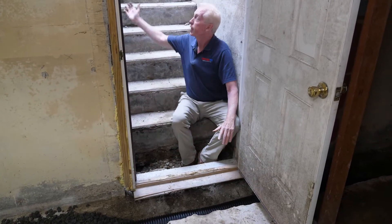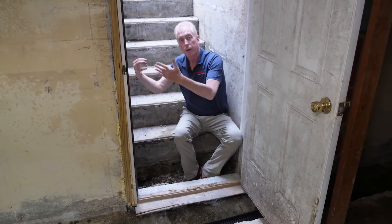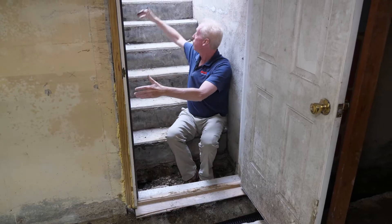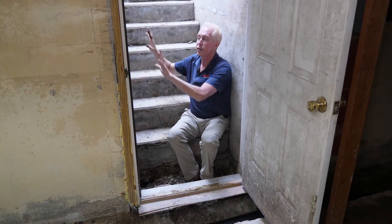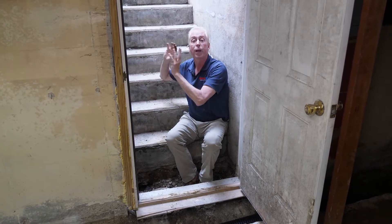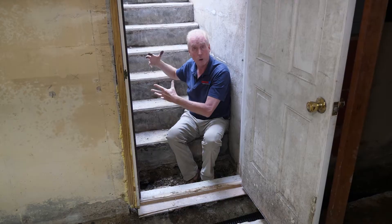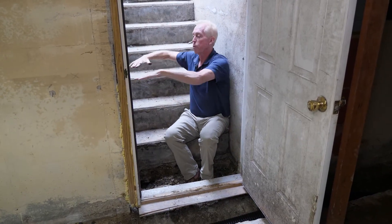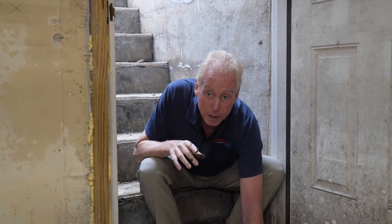Any water getting in here came through six to eight feet of soil down through the backfill. The area on the outside of the walls had been dug out and then soil put back in — they're never going to get that backfill soil as dense as the undisturbed soil. So when it rains, this area fills up with water, pushing down into the ground and up underneath your floor. With the drainage set up the way we have it, you're never going to get that pressure built up underneath the floor — the hydrostatic pressure is completely eliminated.